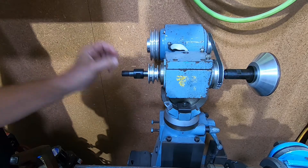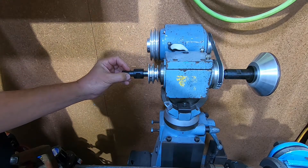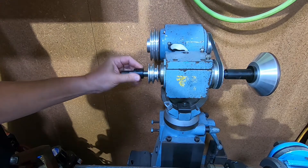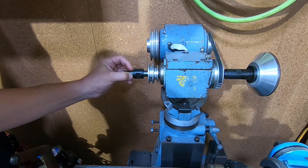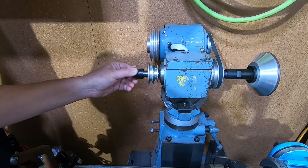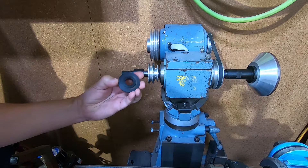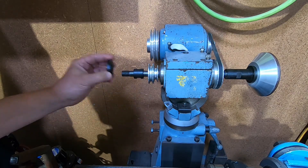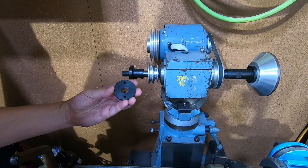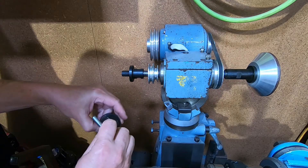For the 18mm end I started with just a bare shaft. I made the pulleys, which I've covered somewhere else, and fitted them. But there wasn't any feature on this shaft against which you could tighten a nut. So I made this collar — it's a close fit on the shaft but held in place with bearing retaining compound. If I ever have to get it off I can just heat it up, and it's got a couple of flats for a spanner. Then of course I needed a flange, a backing flange, the wheel, and then this is the 18mm left-hand thread nut with a couple of holes for pin spanners.